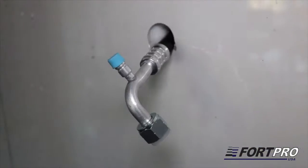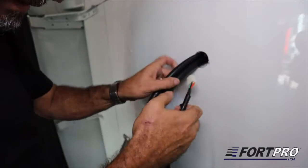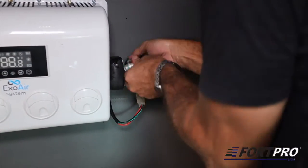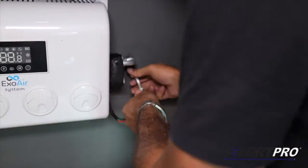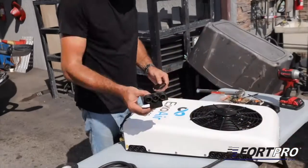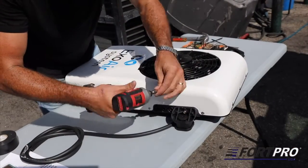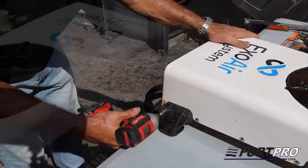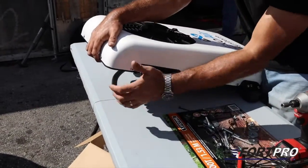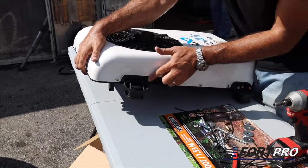The hoses are presented through the hole and the cables from the evaporator equipment are connected to the condenser. The hoses are coupled and adjusted with the security plate. The pads or legs are assembled to minimize vibration from the operation of the truck.